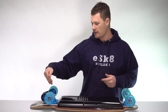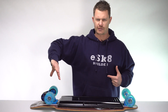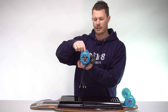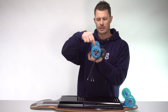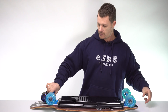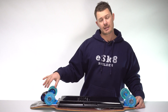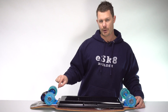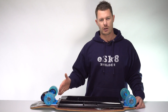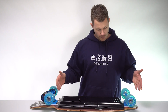If you take the Space Cell Pro case and try to fit it on this deck, it's not going to fit. Maybe if the motor was mounted out the back you could do it. The wheelbase presents a constraint. You can look at other things like mounting the motor out the back, which is possible, but the mount needs to be designed to be reversed. The other way around this: if the motor is in the actual wheel, like a hub motor, you've got a lot more space, and then the Space Cell Pro 4 will fit on this deck.